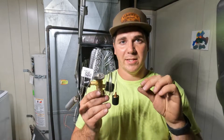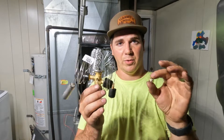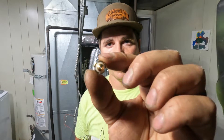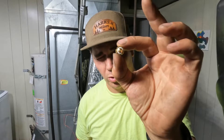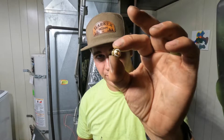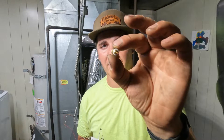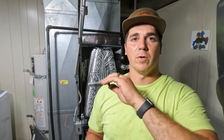To basically simplify this discussion, we have two different setups here. The more basic setup is a little piston that looks like this, and it has a tiny little hole. A fixed orifice is what this is called. It's called an orifice or a piston, and this will just let this amount of freon go into this coil no matter what. As long as the condensing unit outside is on, it will allow this much freon to come in.